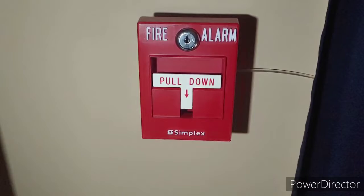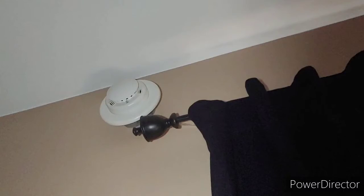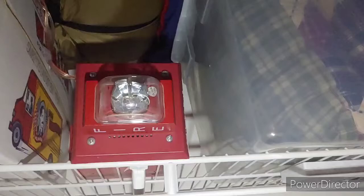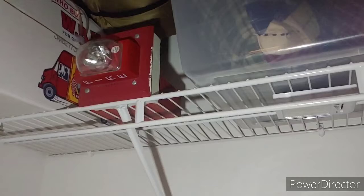Going over here, we have my 2099-9101, same enunciator and key switch, and my MB-G6-24, whatever it is, it's the motor bell 6-inch, and the FX-PHD addressable photo heat and smoke sensor. And then in here, we have this. I mounted the junction box wrong, so I couldn't mount this the correct way. So it's a sideways ISM25-S75S speaker strobe. Yes, I finally remembered the model. In the closet, that's also on the DSM. So I believe our coding is set to continuous. So yeah, let's go ahead and give this thing a whirl.